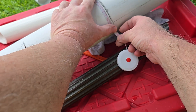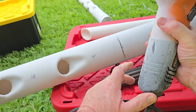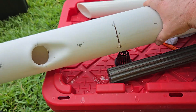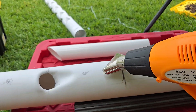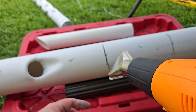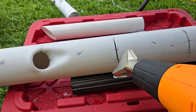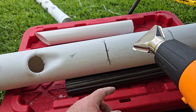From the center mark, I stick the tape at three in the center and mark zero and six. Do the same thing for each one — three in the center, zero and six mark. Then you cut it — you can do this with a hacksaw, you don't have to have an angle grinder with a cutting wheel. Whatever you have to cut this is fine. So you cut it and now you're left with this. Now we have to do your bend, and this is where your heat gun comes in. Each one of these pipes is 25 bucks, and this is only half a pipe since it's been cut — still it's about 12 bucks. Why waste money? So we're left with this, and now we have to heat this up.